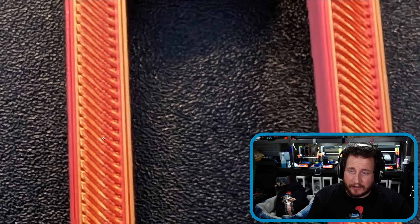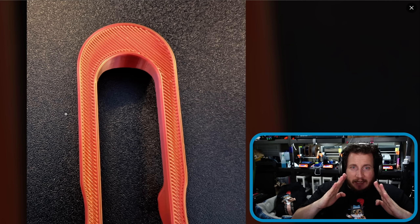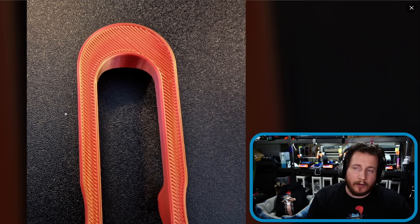Often if you have an idea for what might be wrong, roll with it — you're probably right. This is a Z offset issue. We have videos on bed leveling and Z offset — we'll card to those. You are too far away from the bed. If you can see valleys between your lines, you are too far away — squish it down. If there are ridges between your lines, you are too close. Adjust the Z offset using baby steps on the machine itself, or in the slicer. Just be careful doing it in the slicer — it will apply to every print after that, so if you fix it mechanically, remember to adjust it back in software too.